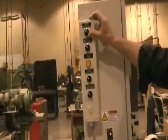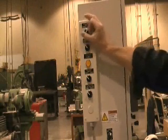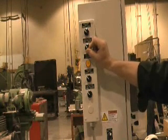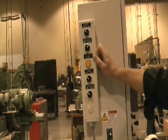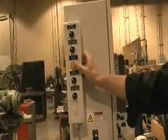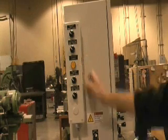Individual height control for each head can be enabled. There are two modes: a timer mode that can be set on the HMI screen, or continuous contact mode where the height sensor is active with the material all the time. There is also a calibration button to set the calibration point that the height sensor will run at.